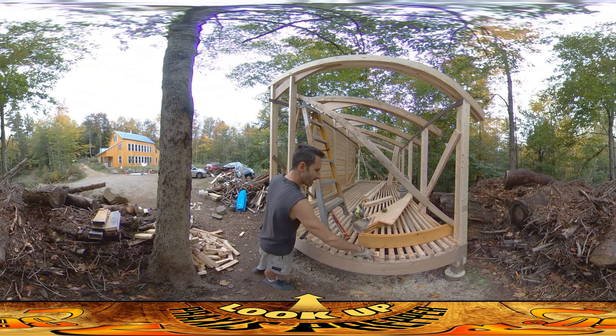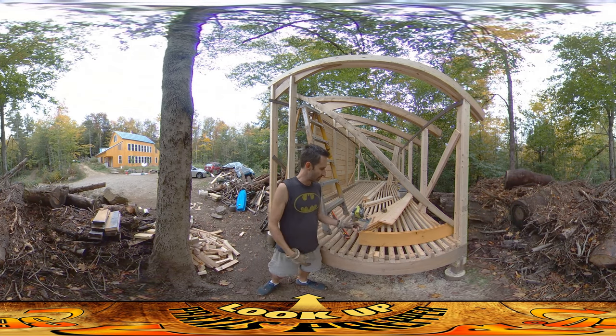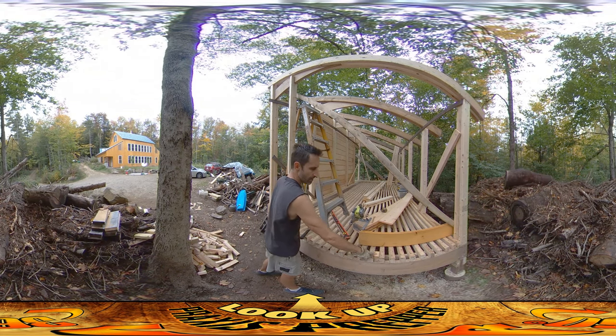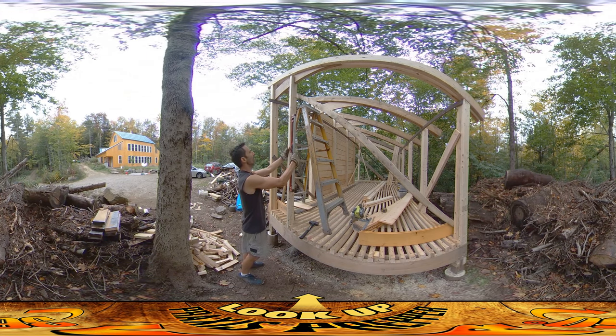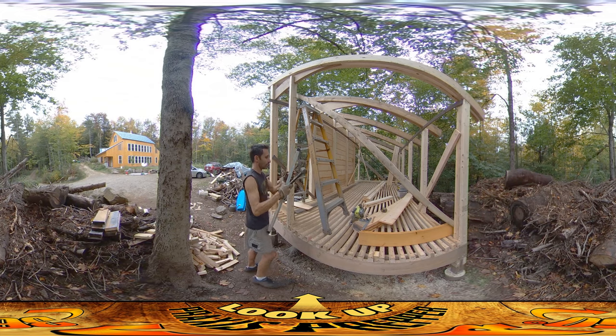I'm thinking about having another post around here because of these scrap pieces, though honestly I've only got two of them so I'm not that concerned. I think I want to do three verticals on this side — one here, and then maybe just a couple over there. So that'd be three on either side. That's the plan. I'm just about to get this first one in — I've got the level here to check plumb. It's bending that way, so I need to go up top to do the tapping.